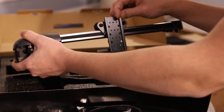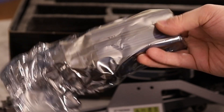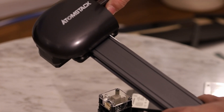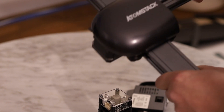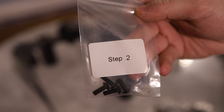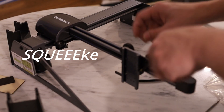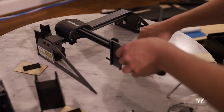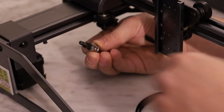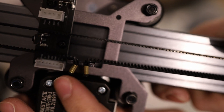This looks like one axis of the motion control system. It uses V-groove wheels that are very similar to what you'd find on a 3D printer. And here's the laser module. This machine doesn't look too complicated to build — it's basically just five parts you have to attach together. Step one is to attach these two axes together. Step two, just put these up on the cones like this. Attach these legs. Make sure the wire doesn't get pinched when you tighten these bolts down. Step three, the belt is already installed on this axis, so I need to attach the belt for this axis. I'm just gonna put these two bearings on the screw along with the cylindrical spacer and then screw it in. Now I just need to string the belt around — I just put these belts into the frame like this.